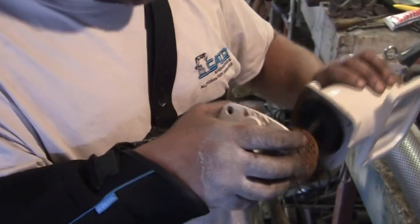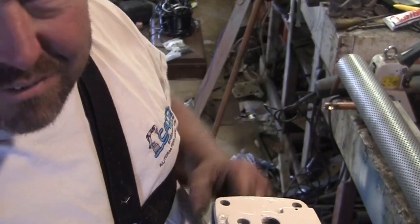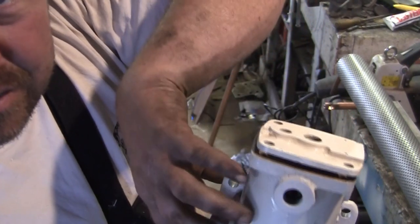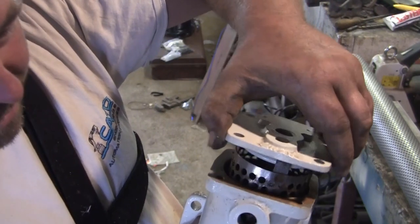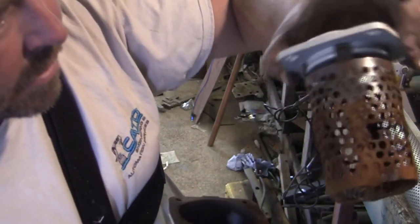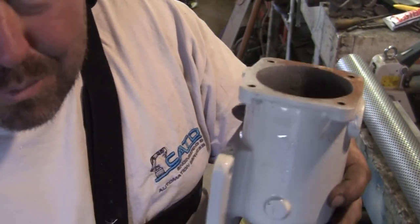Okay, so you've got a nice big cast iron fuel bowl here, mounted to the engine, below the level of the tank. This is obviously a gravity feed system. Fueling is at the front, and this goes into the body of the filter. You do have to get a good seal on this top section, which might be quite tricky as there's been quite a lot of corrosion. We pulled this out, and the filtering really goes on here, and this is more a sediment trap and water separator.